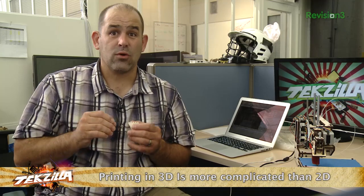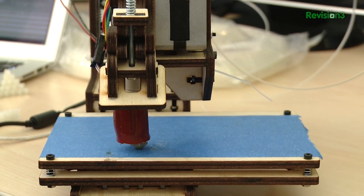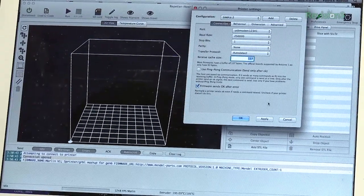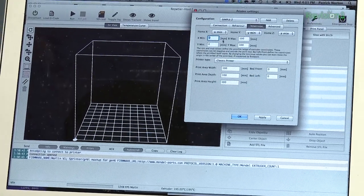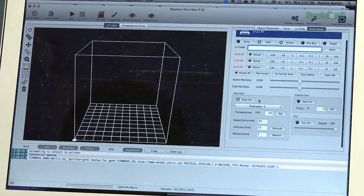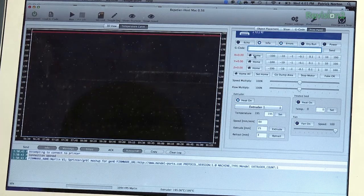Number two: 3D printing is a lot more complicated than printing on paper. It's 0.3mm strands of plastic being injected with precision out of an extruder head to create a model up to 100mm by 100mm. When you first open the Repetier software and start configuring settings, your eyes are going to explode — you have to download an STL file, you have to slice it, and over time you're going to tweak your settings and learn, because certain types of models will like certain settings more than others to get the best results. This stuff is really bleeding edge and really exciting, but you're going to have to be patient.